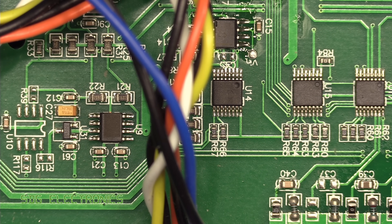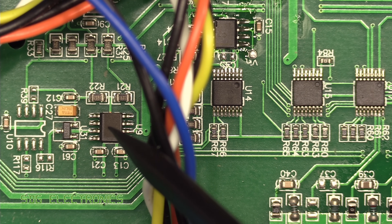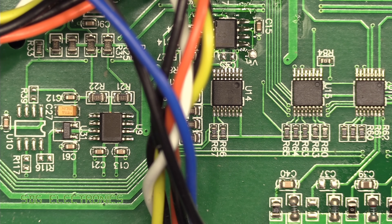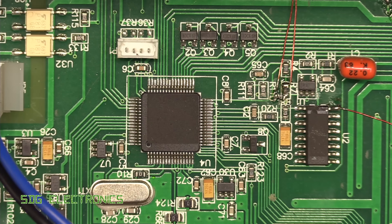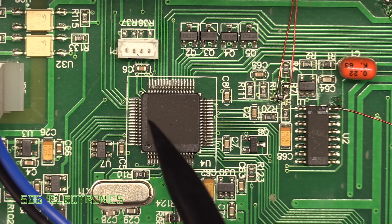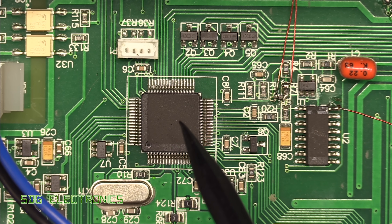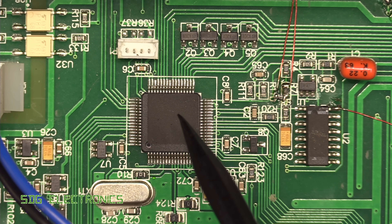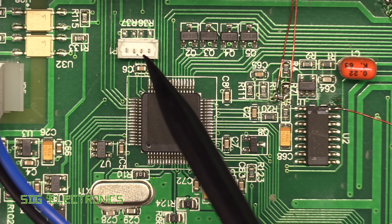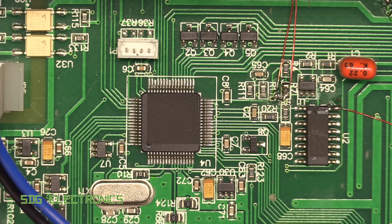Unfortunately, most of the devices have had their labels lasered off. This is the reference chip. The main multimeter chip has been lasered off too, but there are remnants suggesting this is a microcontroller — it says ARM very lightly on the top, so they missed slightly when lasering it. This is just a general purpose microcontroller, not a dedicated multimeter chip. There is what appears to be a programming header, and you can see the full extent of a few bodges on the board.